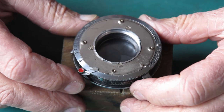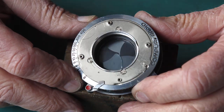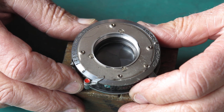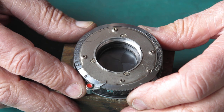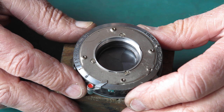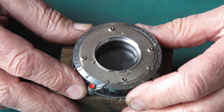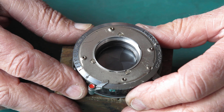But I had a close look, and the screw heads were the key. Typically, the screw heads that hold down the retard gear train get damaged if somebody's been in there loosening and tightening those screws, because getting the speed adjustment correct is a backwards and forwards trial and error business, and you end up making a lot of adjustments until you get things right. There was no sign that those screws had seen any undue use at all, which meant that no one had been in playing with the speed train.